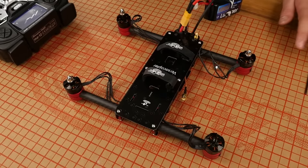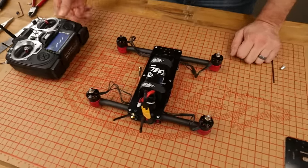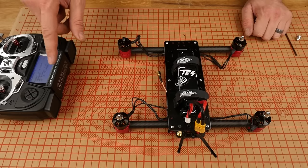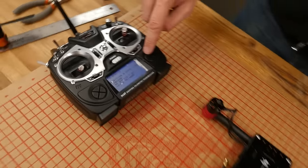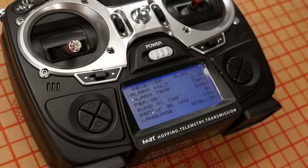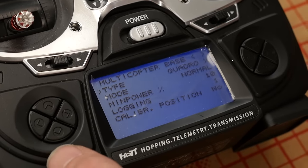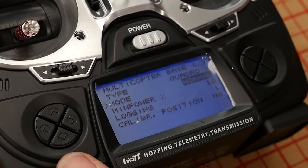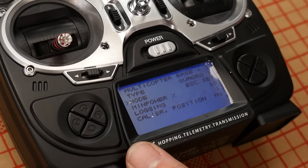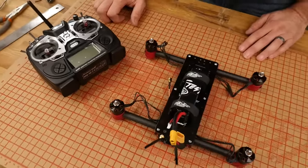For these calibrations, I'm going to turn it so it's orientated the proper way. With the machine powered on and your transmitter, and a successful link, I'm going to hit the telemetry button. The first option is going to be setting and data view — I'm going to hit enter. From this I can view and change my PIDs, set alarm settings. It's a very powerful radio. I'm going to scroll over until I find the page where I find the word mode, then scroll down, hit enter to highlight mode, scroll to make it say ESC set, and hit enter one more time. I can't stress enough — don't ever have your props on during any of these steps, no matter what control board you have.